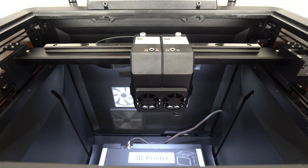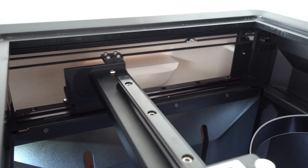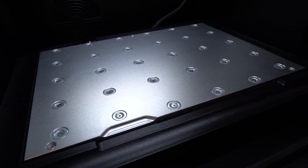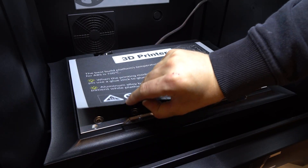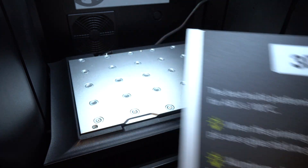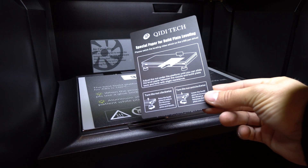On the metal frame there are wide linear rails for every axis including the dual Z axis, so the movements on the iFAST are very stable, precise and smooth. The heat bed on the iFAST is made of a 5 mm thick aluminum plate, packed with high temperature tolerant magnets that hold the steel plate very strongly in place. Thanks to this industrial design, the iFAST is the most stable 3D printer I've ever tested, and once you level it you don't have to think about it for a very long time.